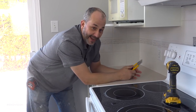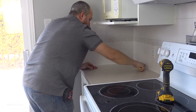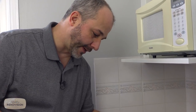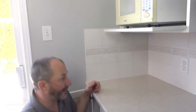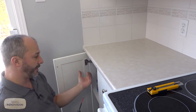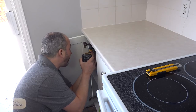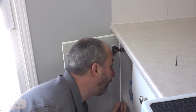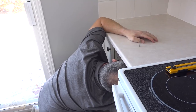Let's show you how to remove this stuff — it's really quite simple. We're cutting silicone. For the most part, countertops are installed with gravity, but because Formica is on particle board and not always flat, it is screwed down from underneath. Usually four corners — find the screw and remove it. This little piece of man-made love is probably about 100 to 120 pounds. We're dealing with a lot of precision and not a lot of room for error.